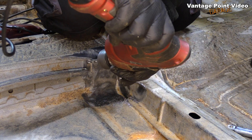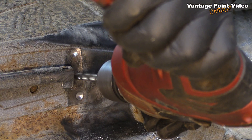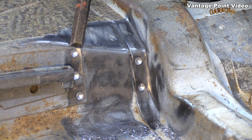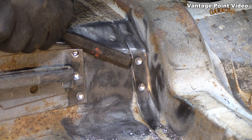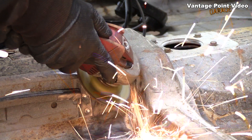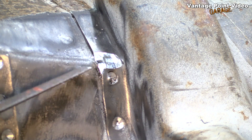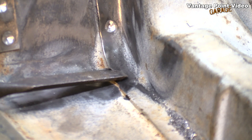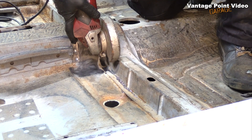Locating the back cross member is a little bit easier. I drill out the spot welds in that cross member and also on the front edge of the rear original support. I went up to about 8mm with the drill bit to get nice and broad without going too far into the floor. I'll pry it loose with the chisel, then make a vertical cut to remove that section and weld it back for original structural integrity. I'll use the cutting disc to go down along it vertically.